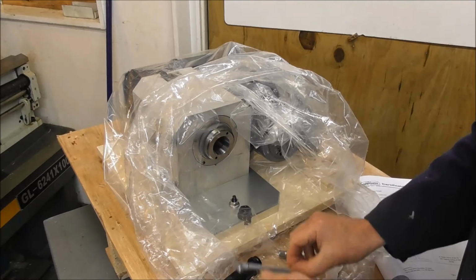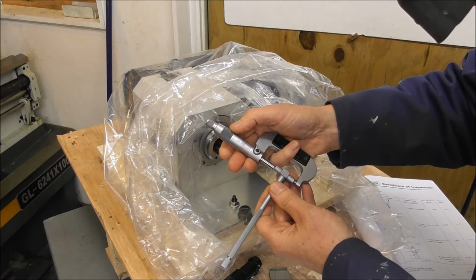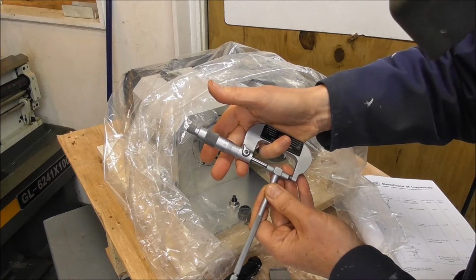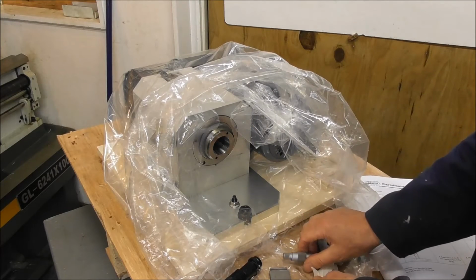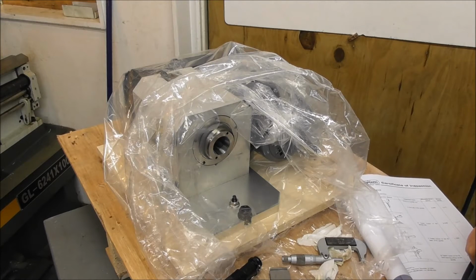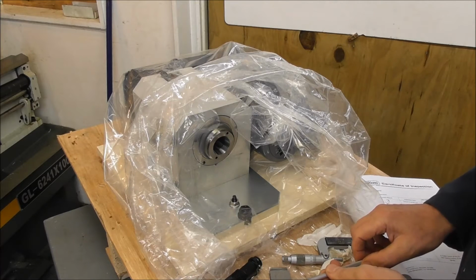And then I've carefully passed the telescopic gauge in that back bearing, and that's quite a skilled process to get it set exactly right. I won't go into that now, but we'll just carefully measure the maximum position, and we're getting, in metric, 31.76. Now that's slightly out of spec. 1.2502 in metric is 31.755, so it's 0.5 hundredths too big, very slightly too big. That's about 2/10 of a thou too big, which is a little bit disappointing, but it's not a massive amount out.